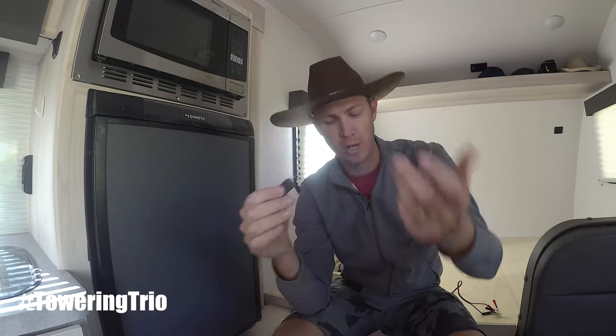I thought about it one night and said let's try this and see if it works. If you saw the other video that Stephanie and I did on our RV furnace, it turned out that our sail switch was the culprit. There was some debris stuck in here — some fuzz, dog hair, lint — and that ball of debris was preventing it from closing completely. There are two wires connected here coming out of the control board, and when the fan motor blows, it blows air against the sail switch and closes this connection — you'll actually hear a little click.